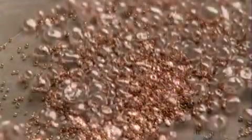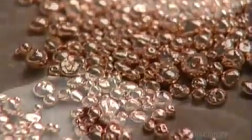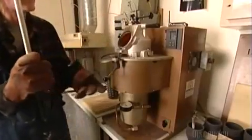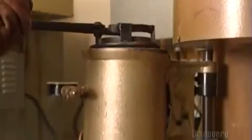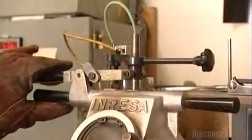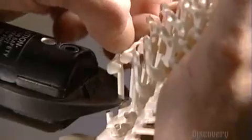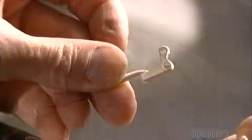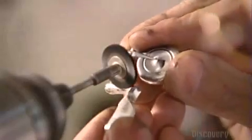The keys are made from tiny particles of silver or gold. These ones have a reddish hue because of their high copper content. The craftsmen pour a carefully measured amount into the casting machine's upper chamber. The machine heats the metal for 12 minutes. The plaster flask goes into the casting machine's lower chamber, and they release molten metal into the cavities. Once the metal cools, they shatter the plaster under cold water, exposing a tree of silver key parts. Using a pneumatic cutter, craftsmen snip off the key parts, which have a dull finish because the silver isn't yet polished.